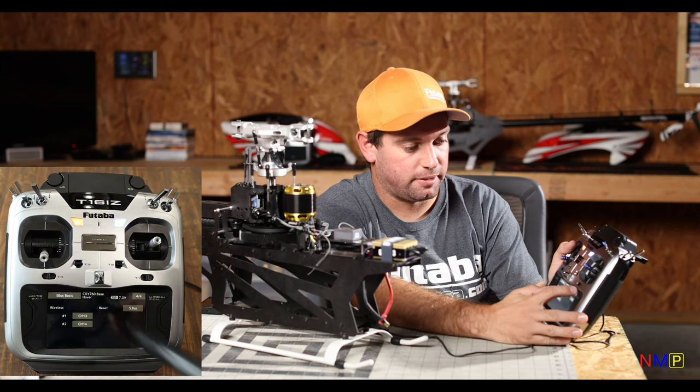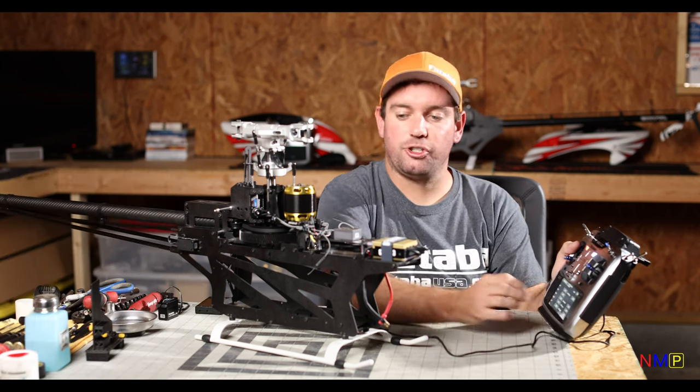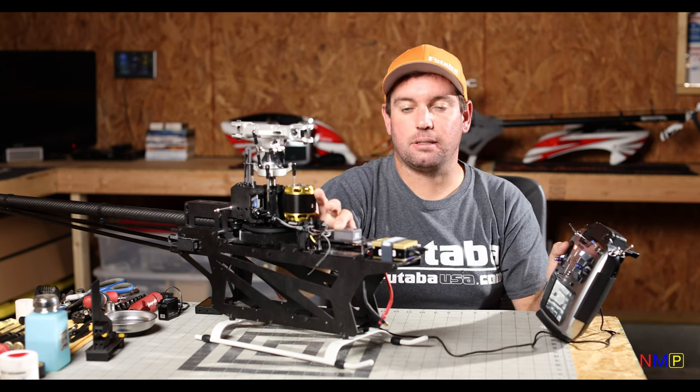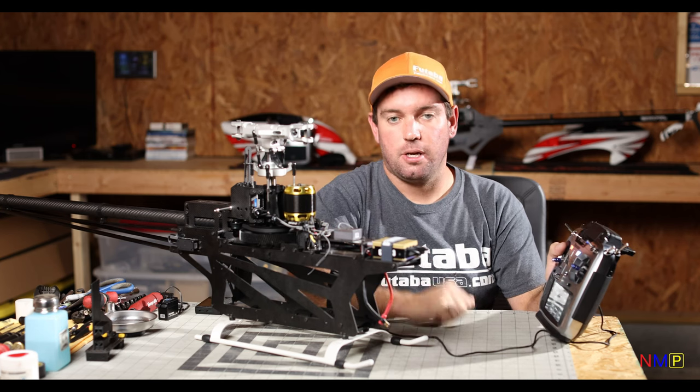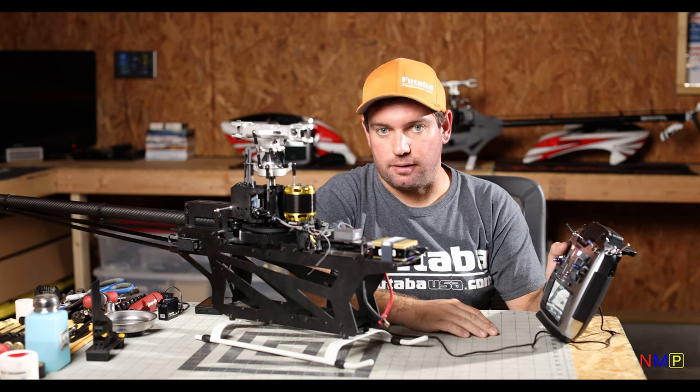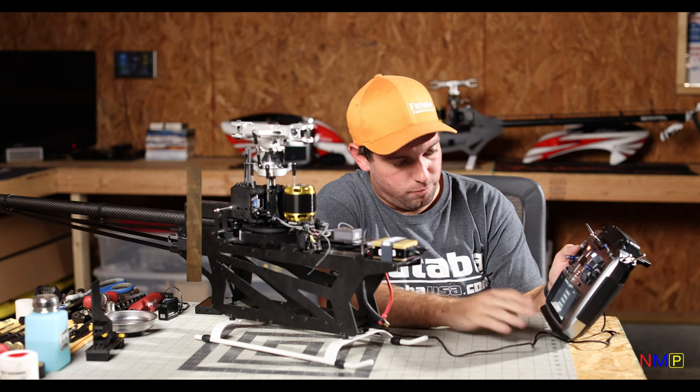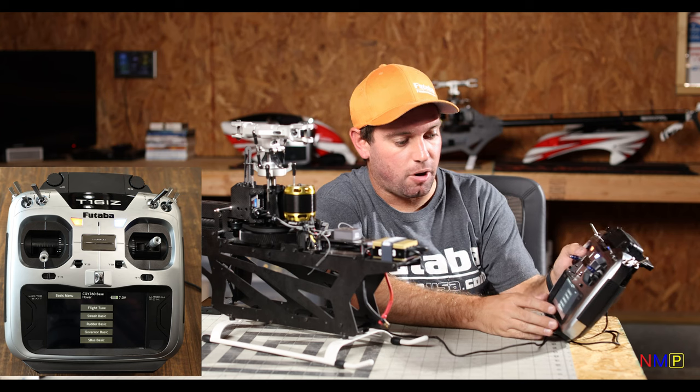Here's your wireless — this is the best feature in the world. It allows you to completely tune this helicopter wirelessly without having to plug in or use the GPB-1. The default is blank. You're going to hit one, hit Inhibit. You're going to see two consecutive channels — you can choose whatever two consecutive channels are in here. I'm going to hit channel 13; it automatically assigns the next one as channel 14. Now you're set up for wireless.